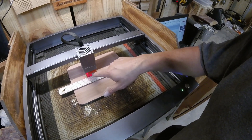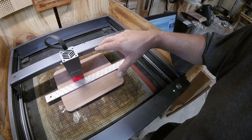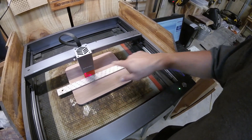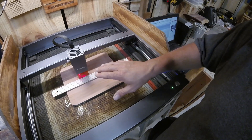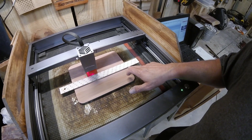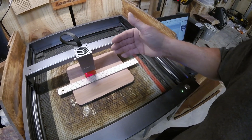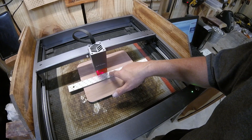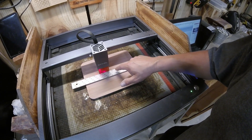When your work area is larger than what you're engraving, framing around the edges really isn't an option unless your image is exactly the same size as your piece. So in this example, I'll show left-to-right centering. I've placed the centering ruler up here — with 60 on each side, that tells me 185 is going to be your center. We found the center of the workpiece without a lot of calculations or measuring. That 185 is set off by itself so it's obvious that's the center.